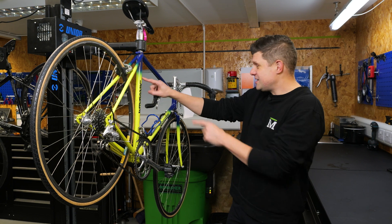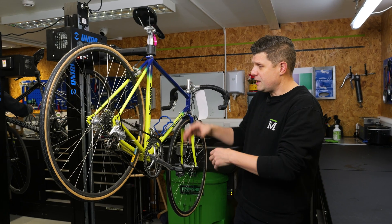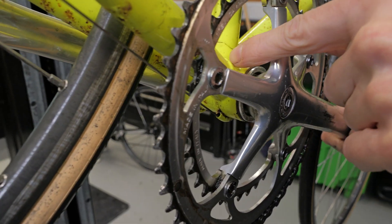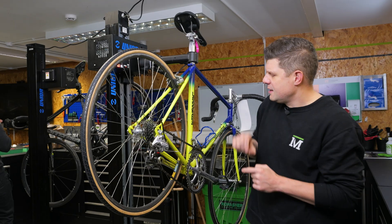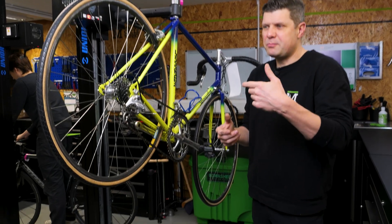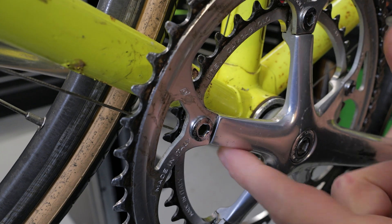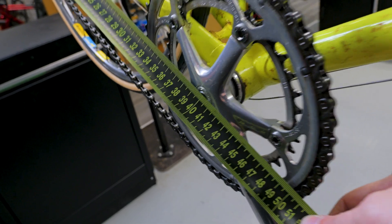I'm going to start with this — a Swinerton Cycles. This is from the era when lots of bike shops actually welded their own frames because you could buy custom tubing, put it on a jig, weld it, paint it yourself. This had a 68 millimeter wide bottom bracket and the chainstays were welded onto this area. You can see it's got very skinny 23 millimeter wide tires, and we want those nice short chainstays — having short chainstays generally means your bike feels more agile and more nimble. We've got plenty of surface area here to weld on a round steel lug and still accommodate a 23 millimeter tire. The chainstays on this are a beautifully short 400 millimeters.